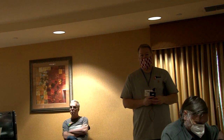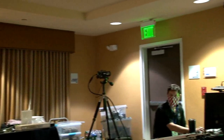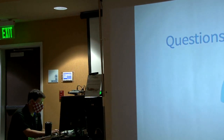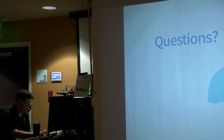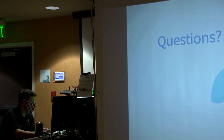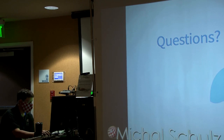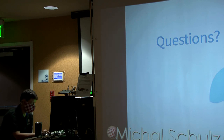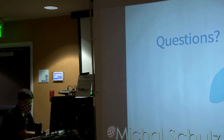No, not really, because I have put all the peripherals of the ARM processor in the very top part of the 4 GB address space, which is defined by every single memory map of Amiga which I have seen as a reserved range, and this is far away from any registers which could exist on Amiga in any way. So I guess it's pretty safe. And on the other hand, since this all is described by device tree, in case of any conflict, I can just move them to an area which is not conflicting. So I wouldn't see that as an issue.